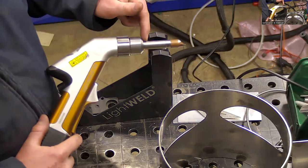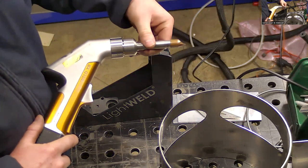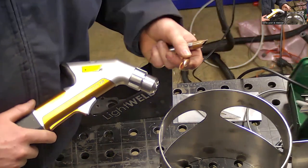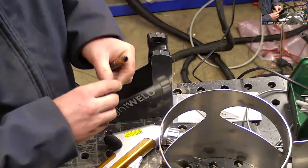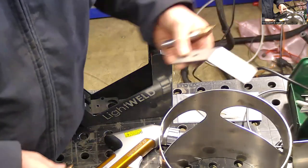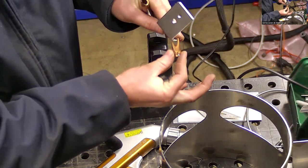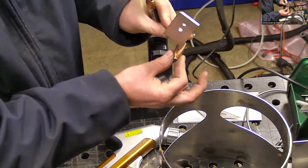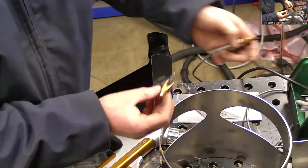And there's a little bit of focus adjustment here. In most instances, we're just going to have these nozzles just bottomed out. But in the case where you're using the fork nozzle, you can get yourself into a situation where you're not in the right focus. So for instance, if you have a fork that's straddling an outside corner, that material is not where the focus point is. The focus point is here. So when the material is inboard of those forks, you're going to need to compensate that.